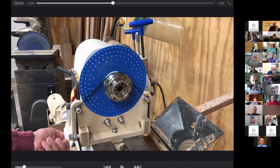Did you say there are two bearings at each location? Yes, just because these cheap Chinese bearings are only 1/4 inch thick, and if you put in just one, there's a lot of angular flex. Okay, so you have two bearings and then a 5/16 rod through there. Yeah, it's an 8. The bearings are actually 8 millimeter, which is like 0.002 inch difference than 5/16. And so there was no drilling or reaming or anything required. It's just as received is how all the pulleys are, and they pass through all the bearings as received.